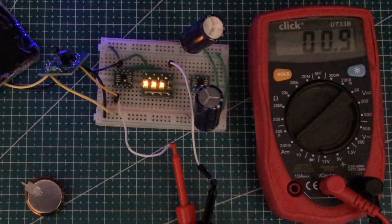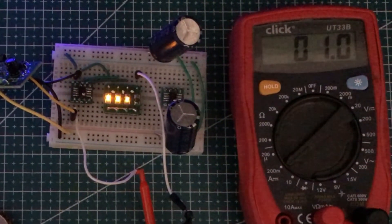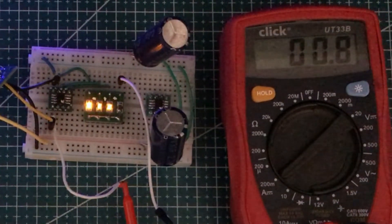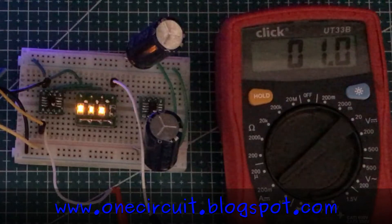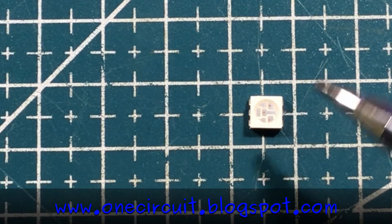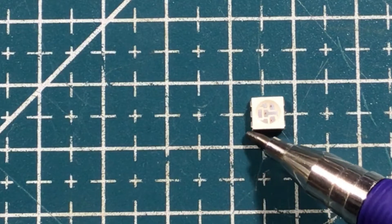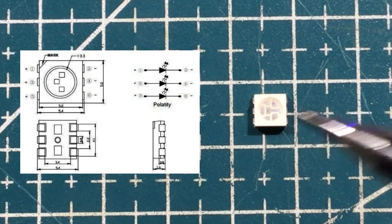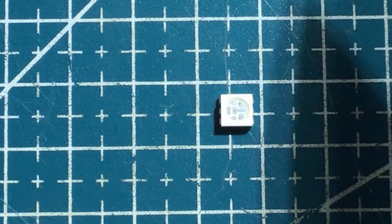The first order of business is to have a look at the original 5050s that I used for this project, take it off the test bed, and get it to perhaps the sort of LED system it's most likely to be using in its final incarnation. Just as a reminder, you can see the three little LEDs in there. There is a bit of a cutout which you can just see in this corner when I cover up that light — that indicates the ground side, with VCC coming in on the other side. Let's have a look and test those three LEDs.